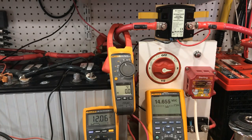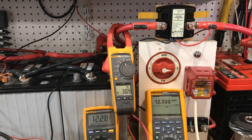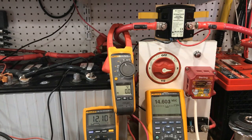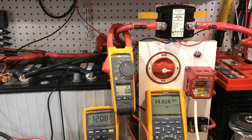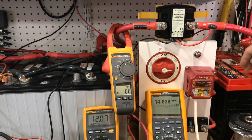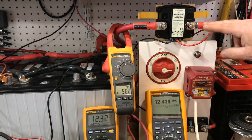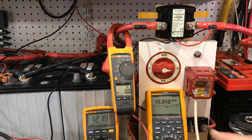To avoid relay cycling, wire your charge sources directly to the house battery. What happens then is the house battery charges, and when it gets to 13 volts it will combine with a fully charged start battery — essentially 99% full. There are a couple of benefits to this addressed in the article, but one is that our maximum inrush current through the relay was 172 amps. If that bank was heavily depleted and the alternator was feeding charge current through, we could max out the capacity of this relay. However, if we reverse that and put charging onto the house bank, when it comes up to 13 volts it will combine with a battery bank that's already almost full, so we'll only be passing a minimal current.